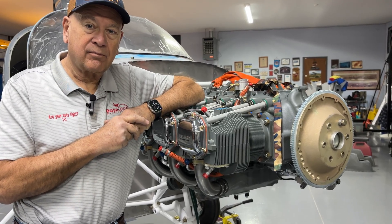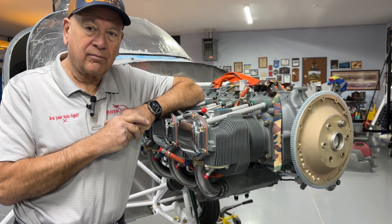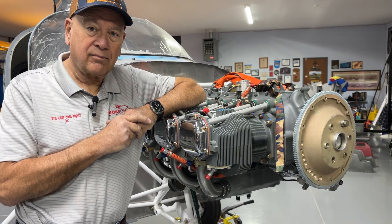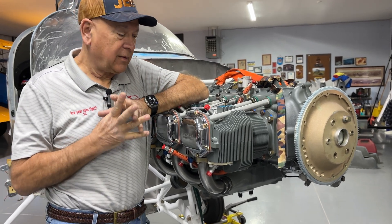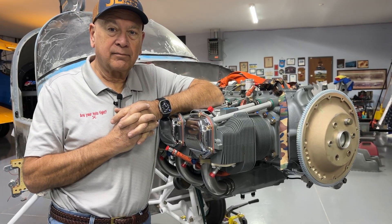However, since we had everything exposed, the pistons weren't quite matching in weights. So we went ahead and bought a set of standard compression pistons, per your request. They all weighed exactly the same — 1,168 grams — and we installed those pistons back into the cylinders.